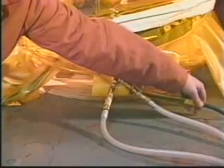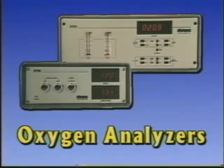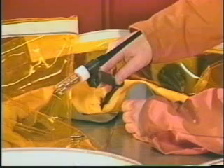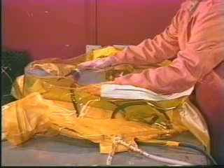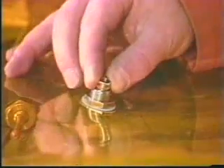Make sure all accessory ports are sealed and always check the chamber and gloves after each use for damage. Load the components into the chamber, being sure to include test coupons inside for quality weld sampling. Oxygen sensing equipment may also be used. Make sure to always purge the TIG torch leads prior to filling the chamber. Next, close the zipper three quarters of the way. Expel the majority of the air inside the chamber by gently pressing down around the parts, then make sure the exhaust vent on top of the chamber and the zipper are closed. Also make sure the inner tubing ring is at the bottom of the draping and there are as few wrinkles throughout the chamber as possible.